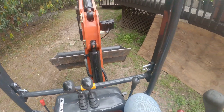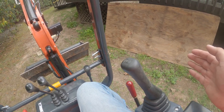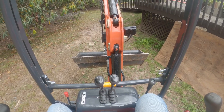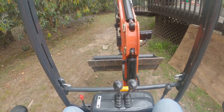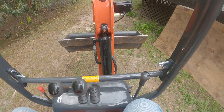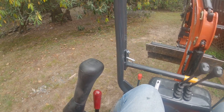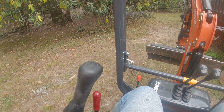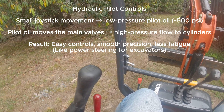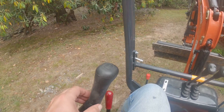A lot of people talk about pilot controls. What are pilot controls? Pilot controls are basically the way you're going to function everything else — all the rest of your functions for the most part, from the swing of the entire unit to your bucket operation, the curl and so forth. Pilot controls also means it's set up in a way that it's not direct hydraulics — there's a separate layer of controls in order to access the hydraulics, versus direct controls like I have on the backhoe feature of my tractor.